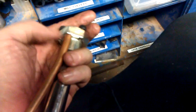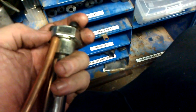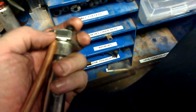Let me show you one more thing that's going to be done to it. Once I've got everything assembled there's going to be an additional hole drilled at one of these corners — I don't know which one, it depends on how it goes together. This copper gas line will go in there and that's what will trap the gas and direct it backwards to eject empty shells via the tapped gas. That's going to go approximately where the original ejector rod went on the stock gun. We're not going to need an ejector rod anymore because we're going to spit out empty shells with gas pressure instead of with mechanical effort one by one.